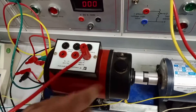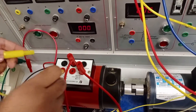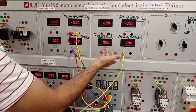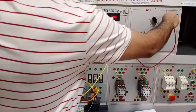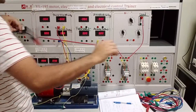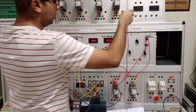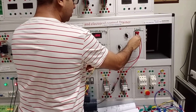The armature is connected such that the positive of the armature is connected with the negative of the series winding. Both windings are connected with the ammeter — take the positive terminal of the series winding to the ammeter. Only a single ammeter is used to measure the amount of current, and it is connected in series with the load. The load's negative terminal is connected accordingly. To measure the terminal voltage, connect a DC voltmeter in parallel across the load.